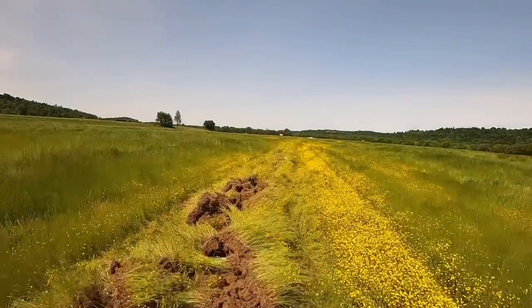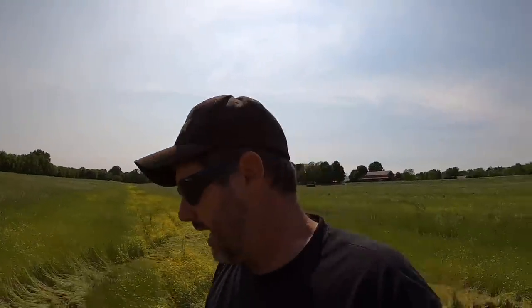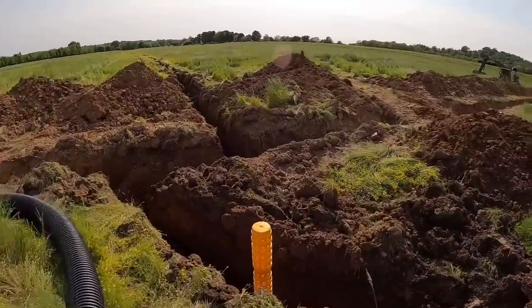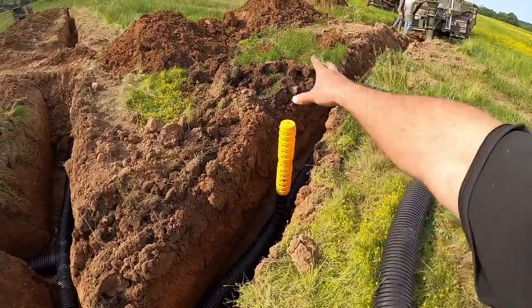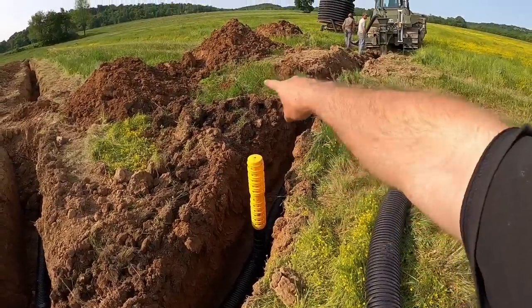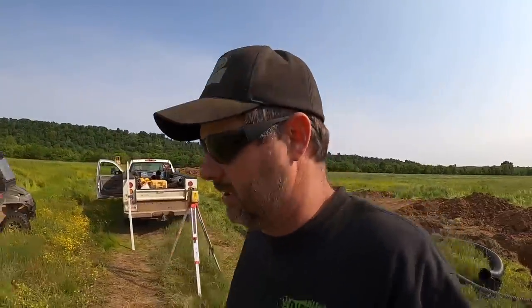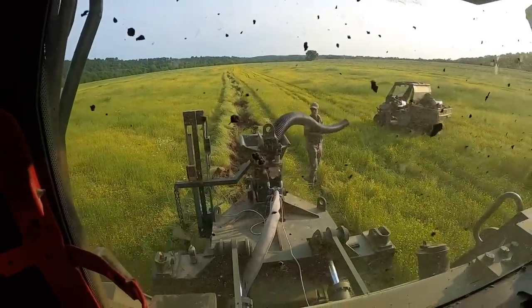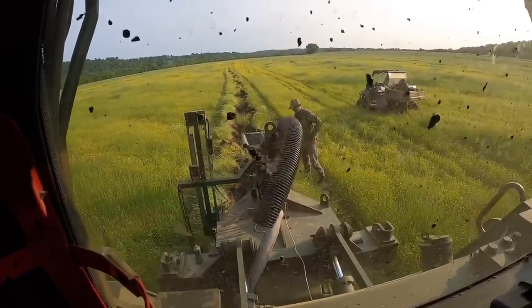This was an 8-inch run — it probably could have been 6. We're going to jump across to the other field where we've got four 3,000-foot runs to run. Matt went to get some pipe. We need to go back up there and dig our next start hole and hammer out some footage. Our one 8-inch line comes up going to a riser tee right there. This is going to get dug out into a little bit of a catch basin — there's a culvert that comes underneath the road right there. At this point we convert to 6-inch, going 3,000 feet that way. We've already got it ran through the plow, got the laser chaser set up, got our grade set. That right there is going to be the end of a 3,000-foot run.